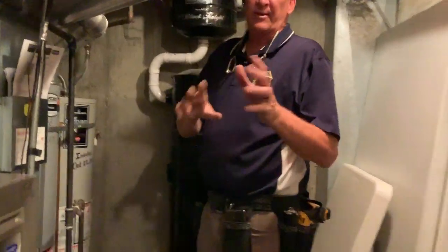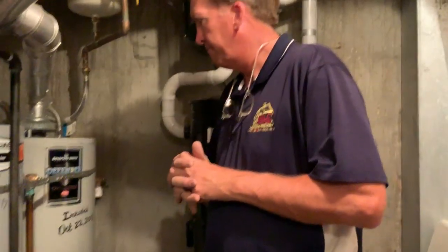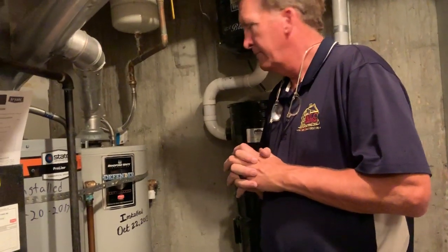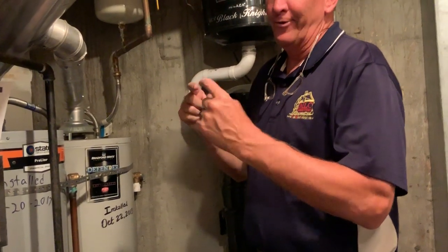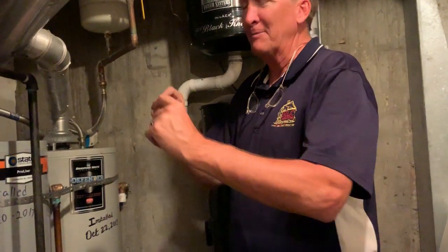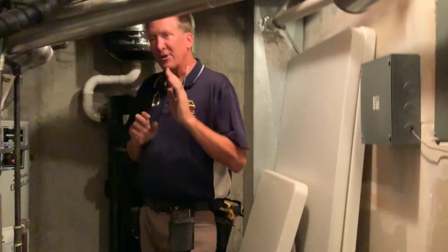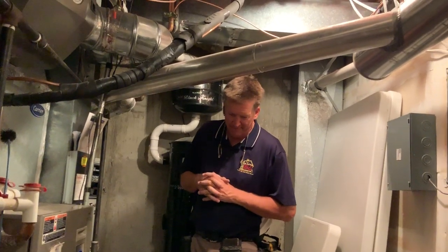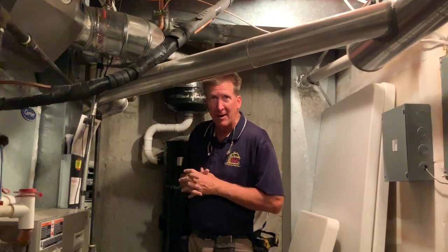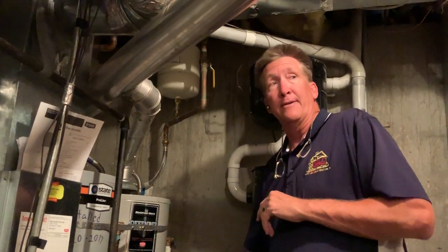These typically go 8 to 12 years. Furnaces typically 15 to 20 years. My Bradford Whites are as old as my house, which was built in '99 — I've got two of them. They make a lot of crackling and snapping and popping noises because every six months you should hook up a garden hose and drain the sediment. What happens is sediment builds up on the bottom, heat has to get through that, and you get the snap, crackle, pop sound. What you're telling me is the Bradford White model — you've totally abused yours — and it's lasted 18, 19 years. I'd buy the same exact model again. The difference between Bradford White and State: State you can buy at the home center, Bradford White are usually professionally installed. But this one wasn't — without a discharge pipe.